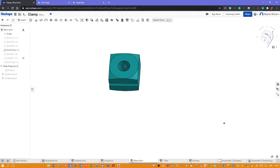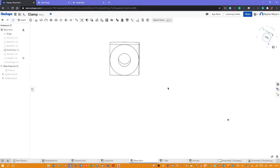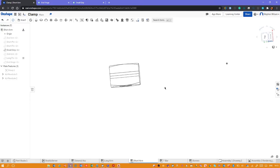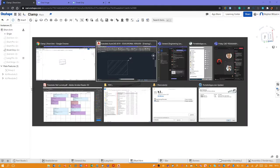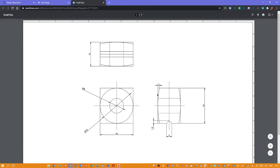There's our front view and there's our top view. Because we're doing first angle orthographic projection, remember when we're looking at the top view on our piece of paper we're actually looking at the bottom of the object. We can see those three lines going across. Let's do that again without the shading so we can just see what that looks like. We're just moving it around our piece of paper like that. If we flick back to the drawing, that's what we're seeing.